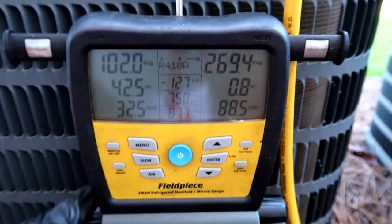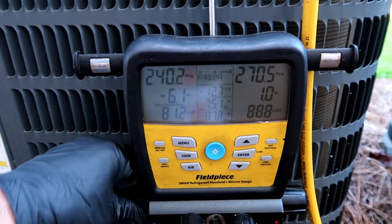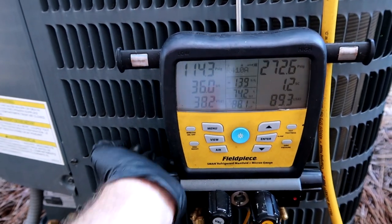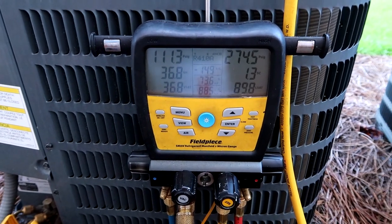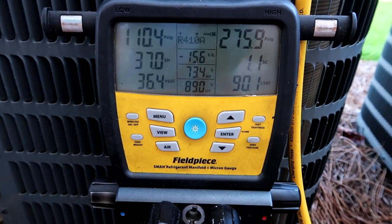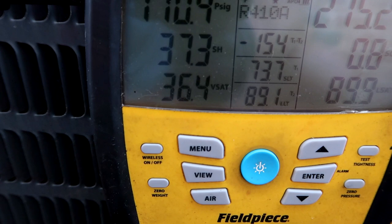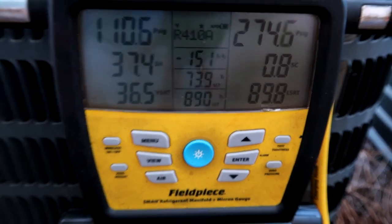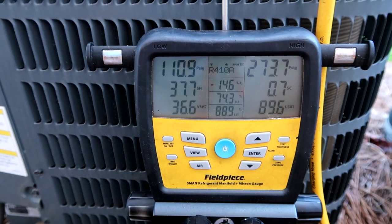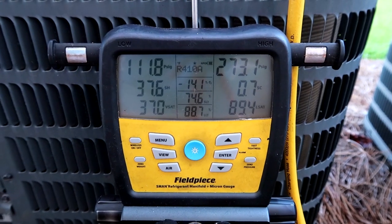It's slowly coming up. I'm on call Monday - we go from Monday to Monday here. Now this is above freezing, so I'm not worried about any ice from that saturation. Superheat on these rotary compressors is always high - I don't know if it's 200 bad TXVs along with 200 bad leaking coils or what, but I didn't build the place. I'm just playing the hand I was dealt the best I can.